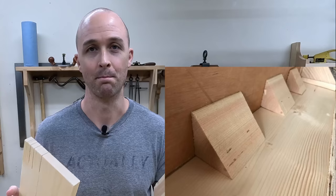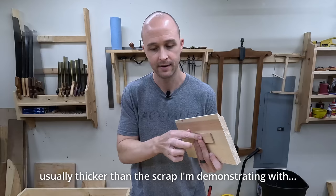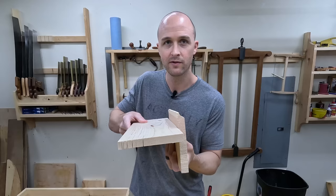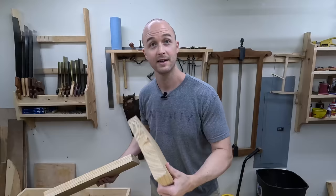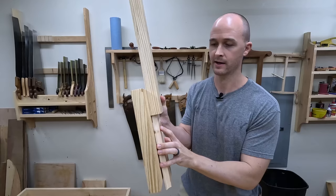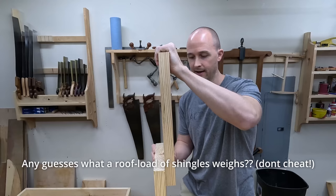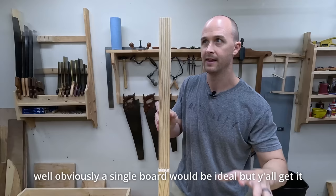A lot of people use glue blocks, but I don't think they're using them the best way. If we attach a glue block — basically little rectangles or triangles of wood attached down the trim boards — then the base is going to sit down into that. Although that's fairly well supported, it's transmitting the force to the trim board, which is then your weight-bearing structure. Think about houses: you would not want a roof tied into the side of a two-by-four wall with just nails and screws and blocking underneath, because when the roof is loaded, it stresses that joint. A much more ideal solution is for the load to go directly on top and down through the wood into the ground — much stronger.